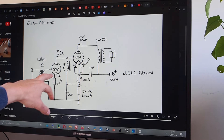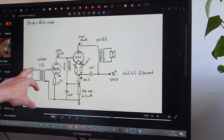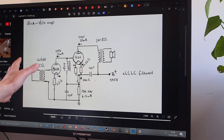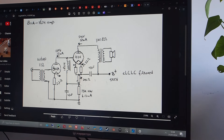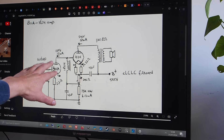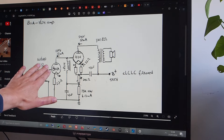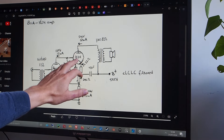The same issue applies to driving the 801A through the input transformer. If you run the 801A at higher current you might improve things, but I found that having a lower-impedance driver for this circuit makes a big difference. Later I substituted an EL33 — an indirectly heated tube with a gain of 20 — and it sounded much better, though still not 100%. I still hadn't fully tamed this particular combination.